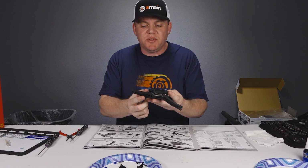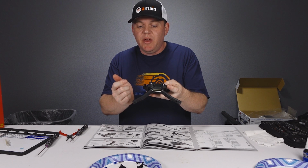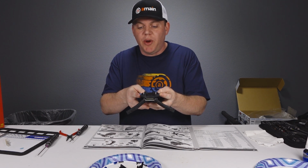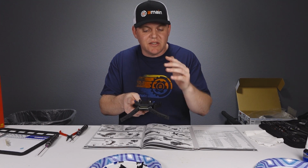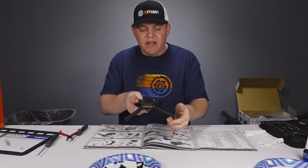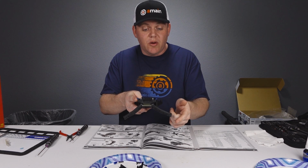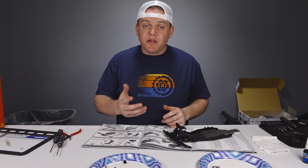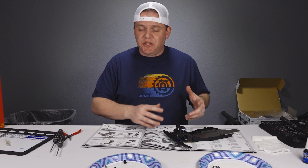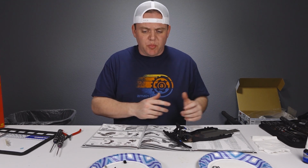With our suspension arms installed, we want to bring them up and make sure that they drop under their own weight. And there isn't much binding. You can tell there's a little bit of resistance because they're not immediately dropping, but that's just because some of the parts or all the parts are brand new. If you happen to find yourself with extra parts, that's okay as long as you've gone back and you've made sure that you did everything in those prior steps.